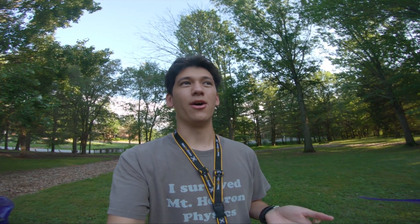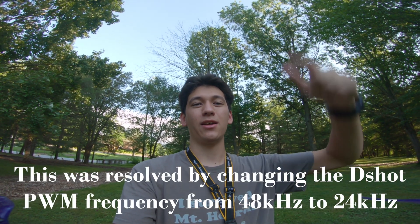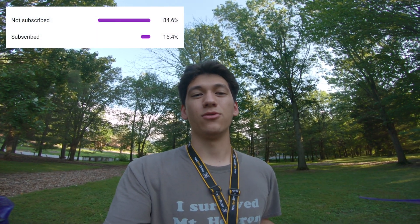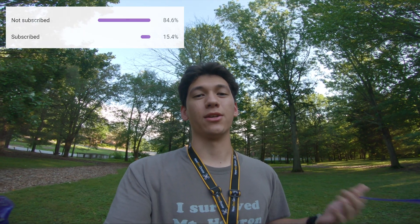So there you go, that was my very first battery. My overall impressions were that it actually flew pretty poorly. There was a lot of bobbling while descending at low throttle, which I think is an I-term tuning issue. And it was actually surprisingly sluggish — I thought it was going to be a lot more responsive with all the feed forward dialed in by default, but that was not the case. I don't think this means 4.2 is terrible; I just think I have to do some tuning. Maybe in the next video I will go over how I set up Betaflight to make it a lot more responsive. I already have a PID tuning tutorial on the channel if you're interested. Please like this video, get subscribed to support the channel — 84% of you watching right now are not subscribed. Thanks for watching.